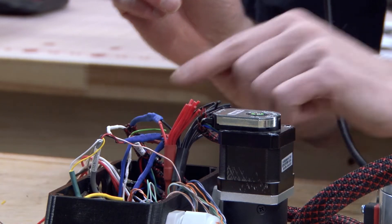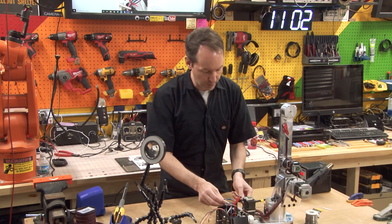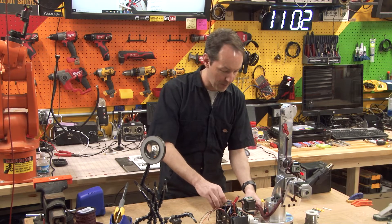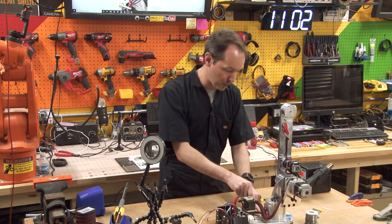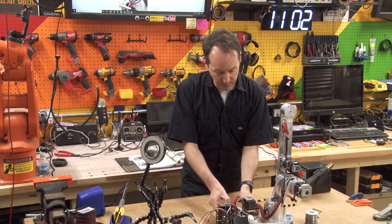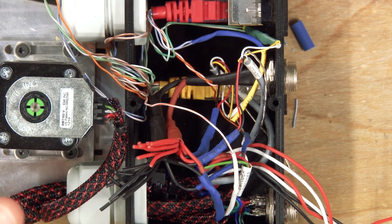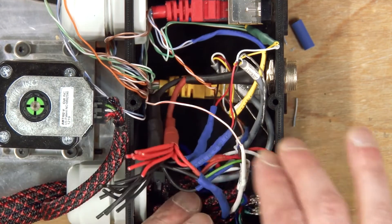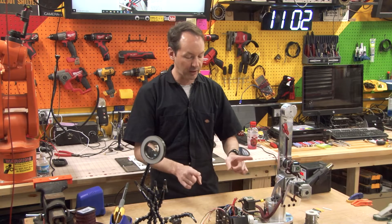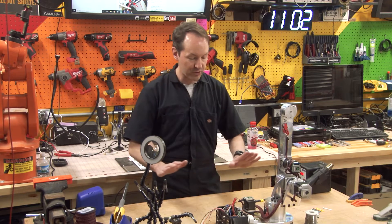Careful with your heat gun — it affects the tubing. All right, we are good. And now J1 is totally connected. I'm going to pull this whole assembly back because J1 doesn't move — it's rigidly in place there — but I don't want to have stress on that cable. If I can pull that back enough where I'm not stressing it, just chill out. We got all that sorted. That's clean, that's nice. That's the J1 limit switch completely wired. We did the signal in the last video; in this video we did the power.